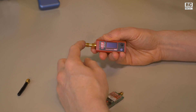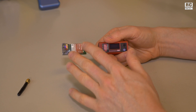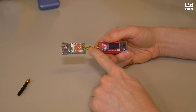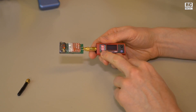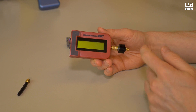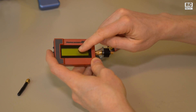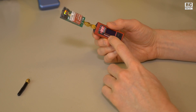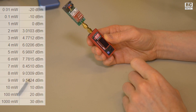We also get this little adapter here so you can directly screw on video transmitters. You can directly see how many milliwatts or decibels leave your video TX and if they are actually as much as they are labeled. This direct connection can be very dangerous if you have strong RF power — it can damage the receiver inside. There's an internal attenuator, which is just an RF resistor — 30 dB — and you have to screw this on for direct measurements to avoid damage. You can attenuate internally up to 30 dB max.